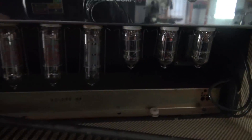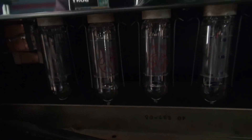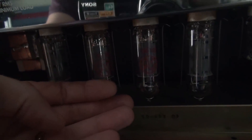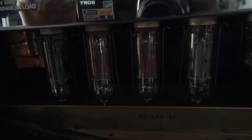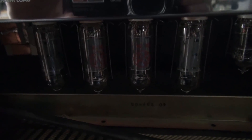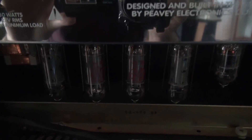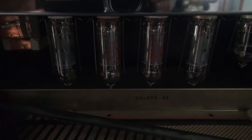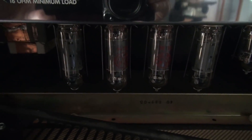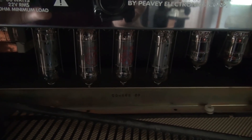Here's the situation. If you take a look close, you can see the filaments are on on the 12AX7 tubes, but the 6BQ5s are stone cold — no filaments. And that would answer why this thing completely goes dead, no output, because the output tubes aren't on. So we're going to have to open it up and inspect the circuit board for cracks. Maybe there's a current limiting resistor that's open. Whatever it is, it should be minor because this is an intermittent issue.